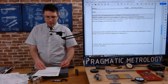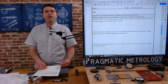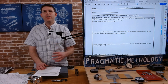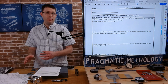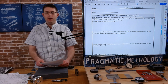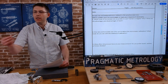What effect did pressure have on your measurement? Do you prefer touch, ratchet, or friction thimble? That's also something you've got to get a feel for. Practice makes perfect. You're going to have to use it in every situation. So I recommend, in this video series, in this sort of educational environment, it's better to practice and screw up here than it is to do it with real parts and realize you used too much pressure or too little pressure. So I definitely recommend you practice with these known size gauge blocks or pin gauges, so that you can get used to your own feel.